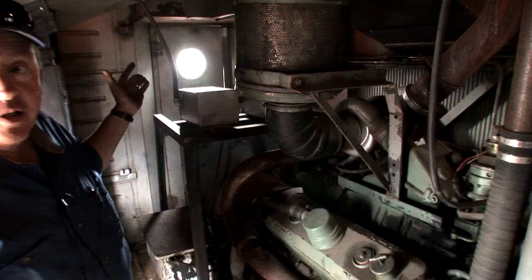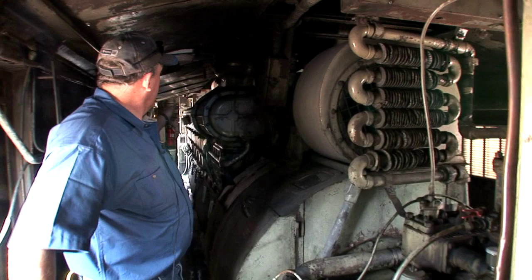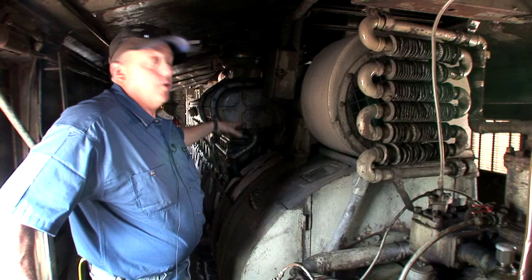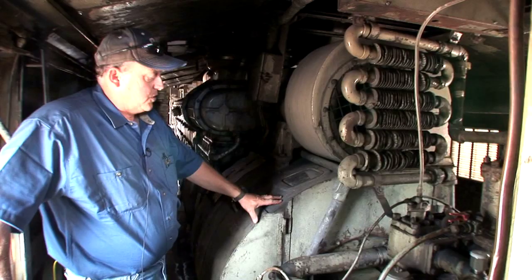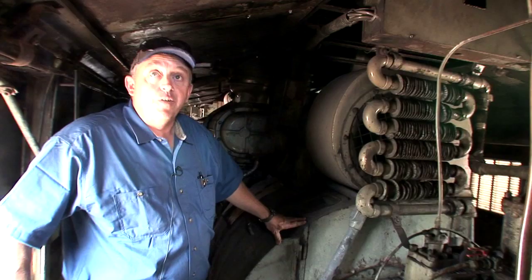This produces 480 volts, and as it goes through the cars it's transformed down to 120 volts wherever it's needed on all the other equipment. To start the engine, you put in the main disconnect switch, which is in the front control panel — the big knife switch. Then you turn the switch back here to prime the fuel pump and fuel rack, which primes the locomotive. Once the fuel line is primed, it'll fire off and start running. It's really simple. This was all done in the late 40s and they kept it very simple and straightforward. This works as a starter to start it, and once it's started it reverts back to a generator. They put the generator field in to energize the generator and start the traction motors moving.